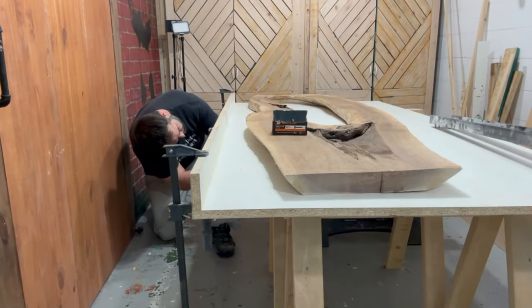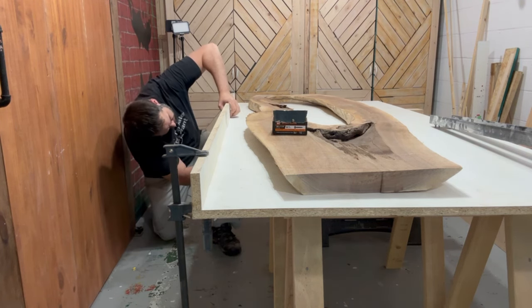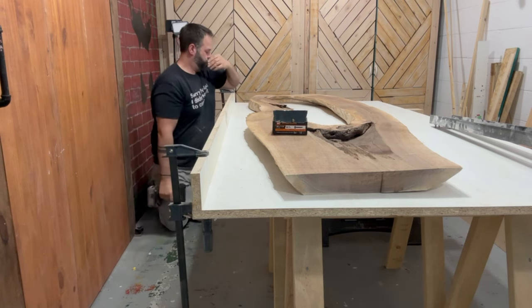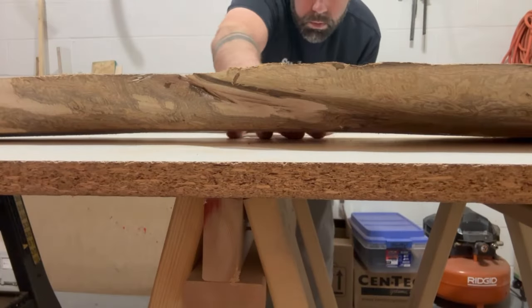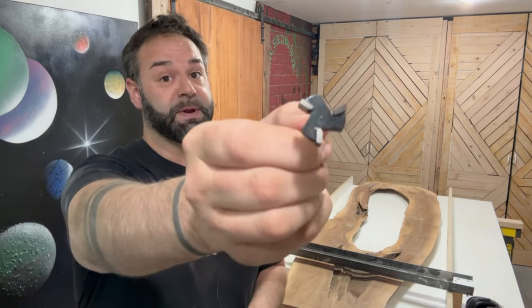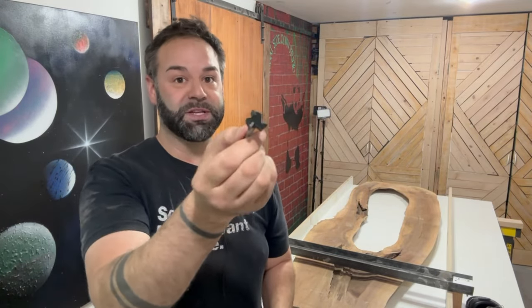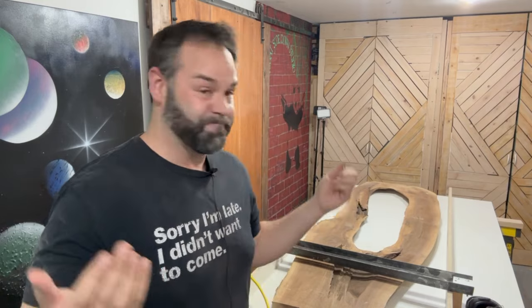After several hours of cleaning, I wanted to whip out the quick router sled just so I could get this down to about an inch and a half and level it off, because there's a bit of a bow in it. And I found my first screw-up — surprisingly it has nothing to do with that. It has everything to do with my complete inability to read descriptions when I buy stuff. The screw-up is my new flattening bit — I didn't read the description well enough to realize it's only one inch, and it came today and I don't really feel like waiting to order a new one.